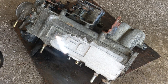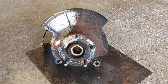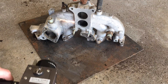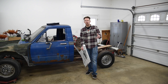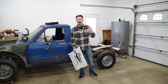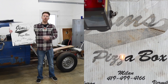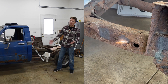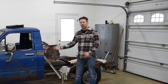The pulsed laser leaves just clean, bare, unaltered metal. And because it's not incinerating whatever is on the surface, there's also less smoke in the air than with a continuous wave. It's perfect for engine parts, wheels, thin metals. In addition to steel, it's also ideal for softer metals like aluminum and brass. I've seen videos of people using pulsed laser machines to remove paints and varnishes from the surface of wood without even burning it. I even used the pulsed laser machine to remove the ink from a pizza box. You could clean a large piece such as a frame with the pulsed laser machine, but it would take a fraction of the time with a continuous wave machine. Aside from speed and cleaning large objects, pulsed is superior to continuous wave in about every way.